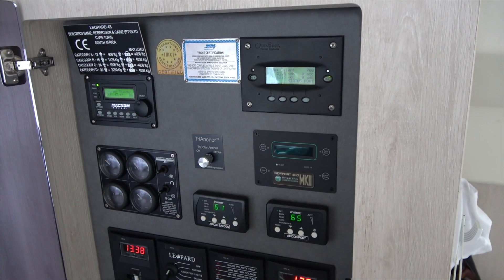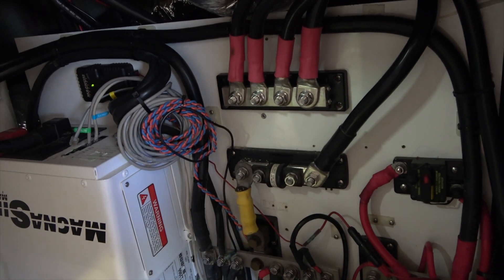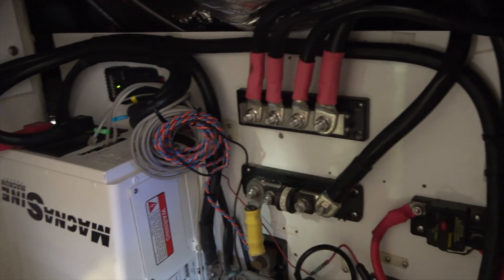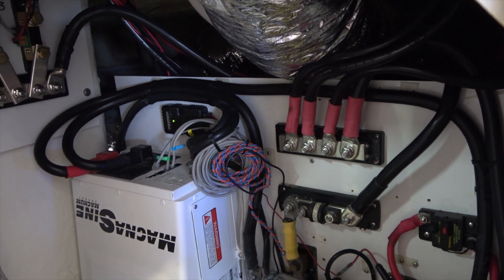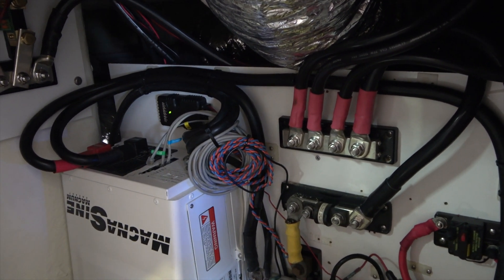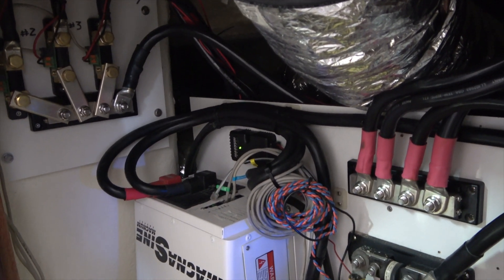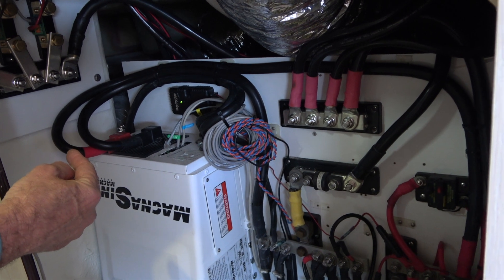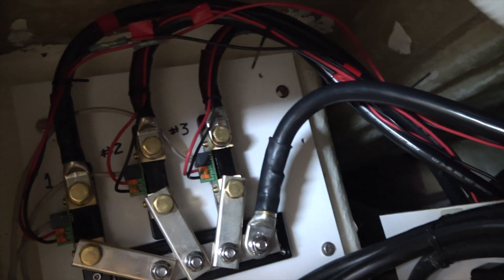I just turned the charger off because we don't want to charge one battery at a time. We mounted three 300 amp hour lithium-ion batteries in place of the old lead-acid batteries. The old lead-acids were all joined together at the battery compartment with one set of leads going back to the main bus area. Instead, we brought separate leads for every one of the batteries so we also have room for a fourth. You'll see four positive leads and four negative leads coming from the battery compartment to this bus, plus smaller wires and resistors for the three separate battery meters mounted up in the nav station.